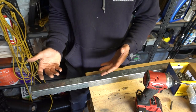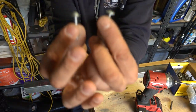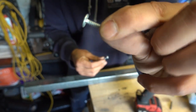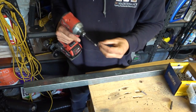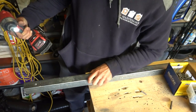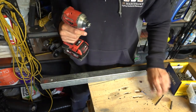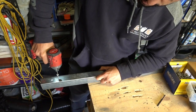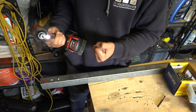Now we're going to test the screws on some metal — fence posts, which is very common material. We'll use a contour head, or wafer head screw. First the regular wafer head with a Phillips drive, then we'll switch to the MultiOne with star drive. The regular wafer head goes in — it's designed to squeeze two materials together, so we don't get that final ratchet action. Switching to the MultiOne, that one was definitely a lot quicker — very nice. We got that ratchet action at the end with a really secure hold.